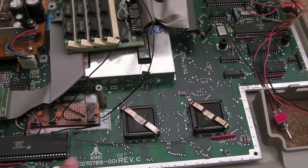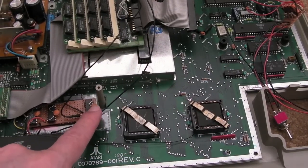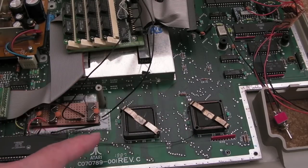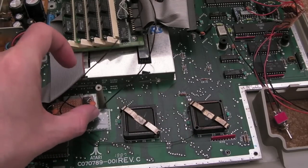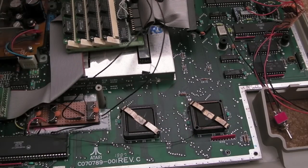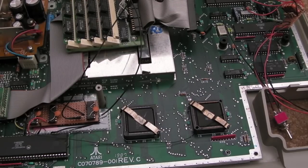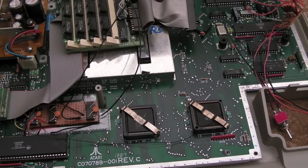They're fine, you know, like this, where you've just got one there and it's permanent. It's just sitting there and it doesn't really get moved. It's the same with the one that goes to the shifter chip to feed the 16 megahertz in. But for wires that are leading to switches and things, they're just not good. They just break off every time you're in there and in and out of the machine. So I replaced those, shortened them, and tidied it up a little bit.